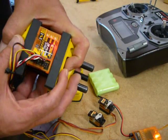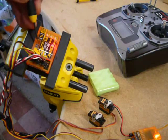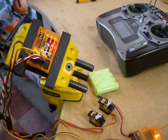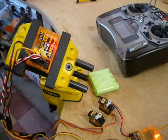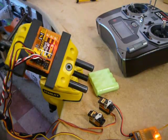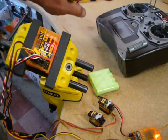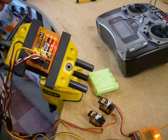Now, you have to be a little bit careful here. Here are the gain controls, and here are the dip switches. These dip switches do control the direction of the servo, but not only that — they actually control the direction of compensation movement. For example, when I first set this up, the rudder channel on the DX6i was reversed. I put this into a model and rudder was reversed. Everything worked fine, except that when it tried to compensate, it actually compounded the problem — and in flight that might just equate to a downward spiral. So be very careful with how you set up these dip switches. The flight stabilizer box expects the normal output from the transmitter and not reversed. Do be very careful when setting these things up that you have the right direction of compensation.